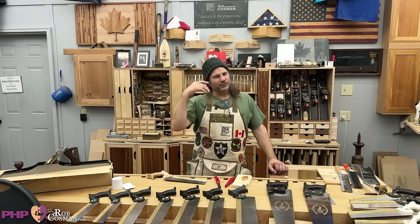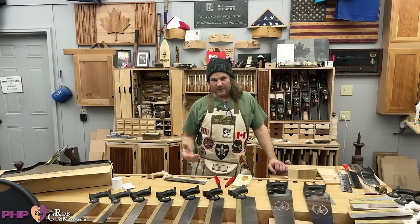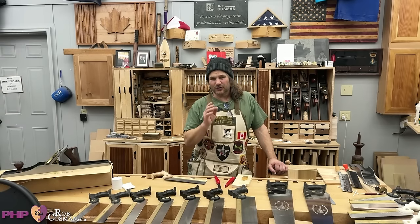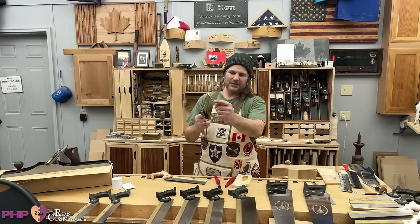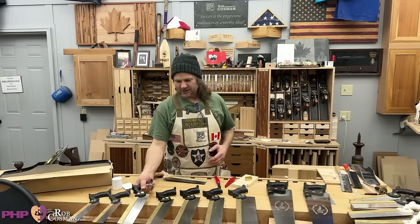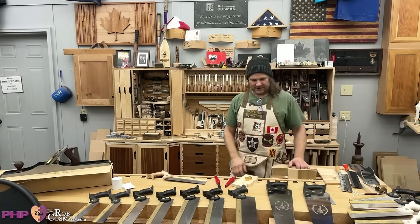You can fight with the old saw that you have, even a lot of the ones that are out there now. You'll fight with them. I know. I made my saw simply because the ones I was selling, 60% of the people that bought it could never get it to start accurately. And if you can't get it to start accurately, you're lost. Mine have these little tiny teeth up front, the first 2 inches. Little small teeth allows you to get it started precisely. Then, boom, away you go and lots of speed. Next question, please.